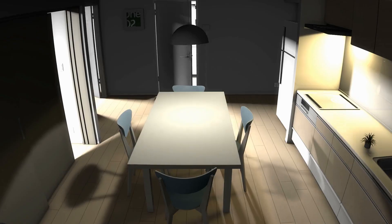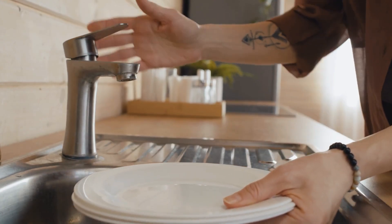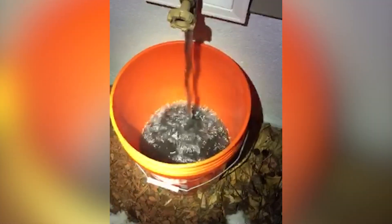There are also situations that come up unrelated to time. Has your well been flooded? If so, you have to get your well properly sanitized and serviced, and then definitely retest. If your well has been through an earthquake, that can often quite dramatically change the water quality, so get your water tested then too. If you've been in an extreme drought, that's another good time to test, because as water levels drop, the water table and contaminants can change. Finally, if you notice any change in the look or feel of the water — whether it seems more corrosive, or there's sediment, iron, rust, or sand — that's also the time to test.